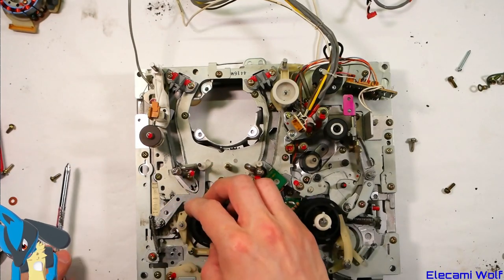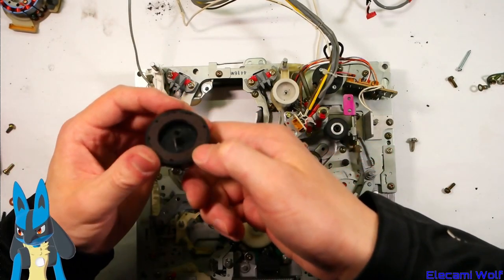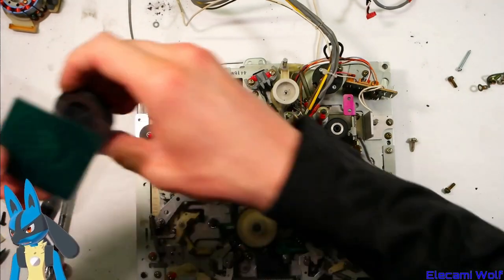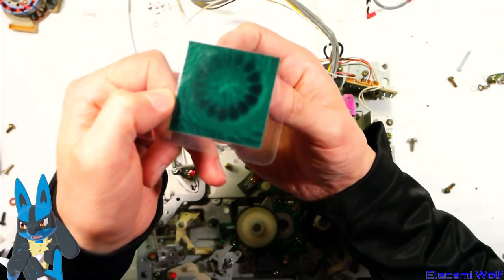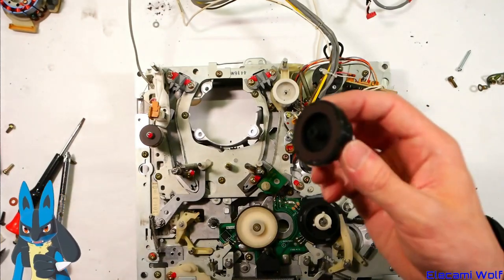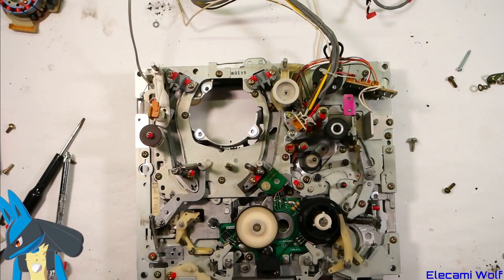The picture is really bad other than in cue-and-view mode. That's a hall effect device there — there's a multi-pole magnet. Using magnetic viewing film, look at that — you can see the multi-pole magnet with lots of poles. That would be giving a lot of pulses on that hall device as this turns, so it can have very precise knowledge of its position. That's quite neat.